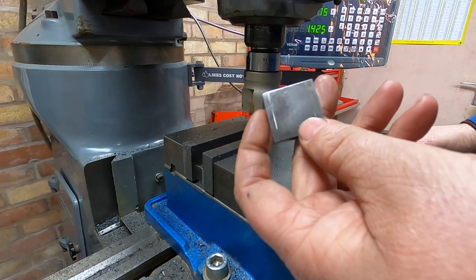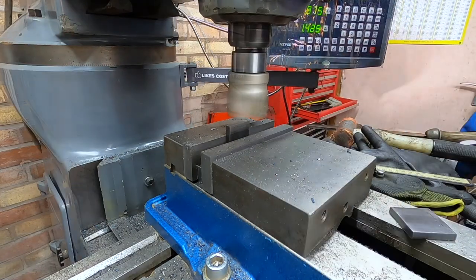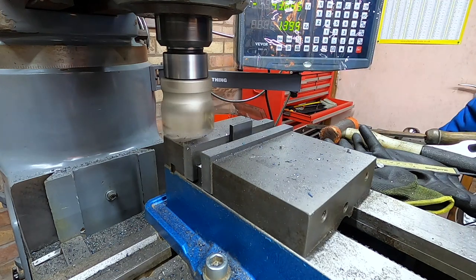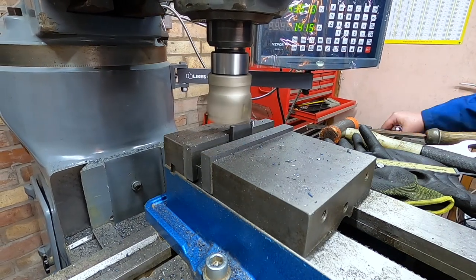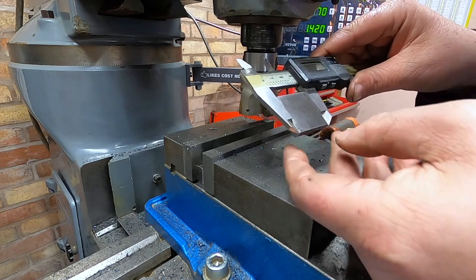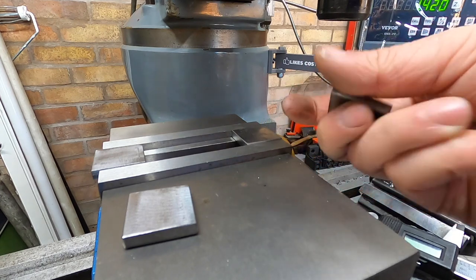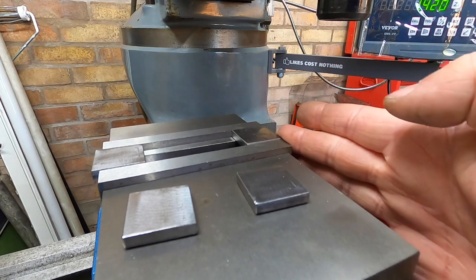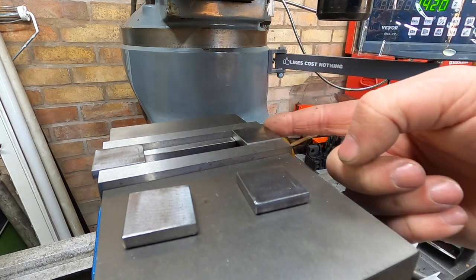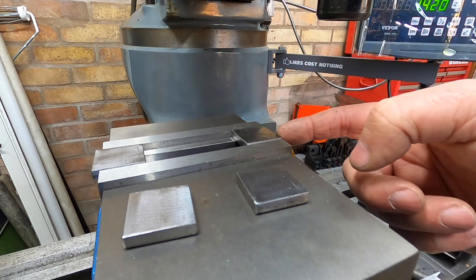Look, dirty. These are going to be the tops — there's a hole to go in for the springing mechanism to go through. They're all the same now. I've got these plates in, I've deburred them, I've got rid of all the black. I've got one set up here, it's flush with the end. I've used this parallel to make sure it's all flush on that edge, then I'll get my edge finder and come off that edge, then come off the back of the jaw, because we want a hole 12mm from this end and 12mm from this front edge.